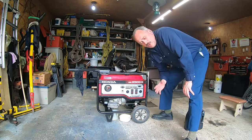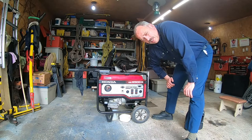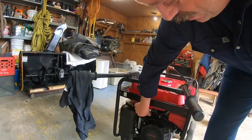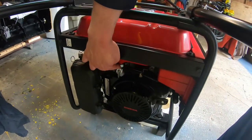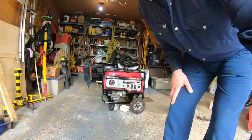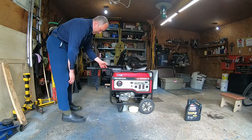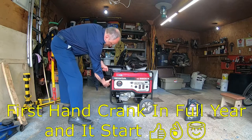If you are doing electrical work, you need to ground the generator. But I'm just going to start the generator itself. I forgot one thing on this side: put the fuel valve on. This is off, this is on. I always forget that. We already checked the oil level, so we're good. Of course, the muffler is pointing that way, far enough away. And like the book says, good hand right here. Everything is on.